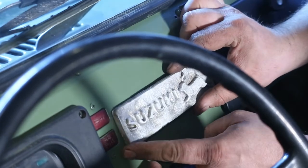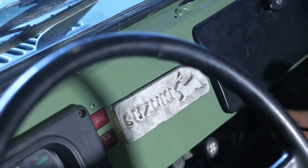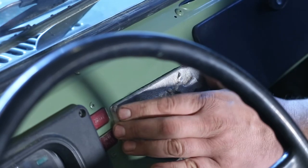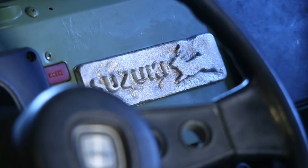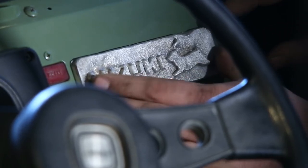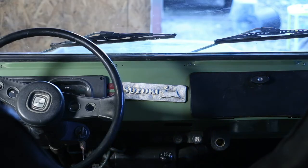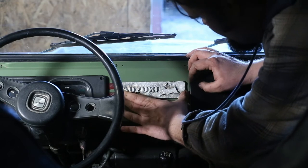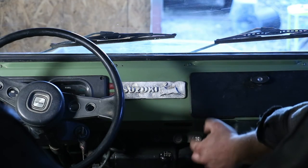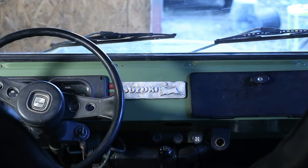My initial plan was to make a faceplate to cover the radio hole in the dashboard of my vintage car. This first prototype is not going to be used, but there are some lessons to be learned. First of all, reusing the mold from my first failed attempt had something to do with the rough look. Secondly, and most importantly, I should have kept the mold in an oven for many hours at a temperature well above 200 degrees Celsius — that would have ensured no water remained trapped in the mold and my casting would have looked much nicer, preserving detail and sharpness. But even though I wouldn't put this piece on a car, I sort of like the look of it. It is more suitable for art projects, for something that has to look old or traditional. Maybe in the future I'll be doing some abstract artworks that will benefit from this sort of look.